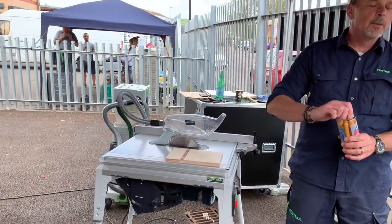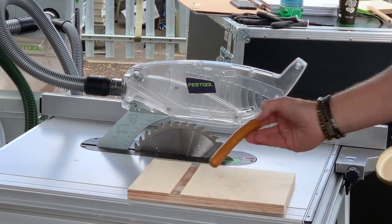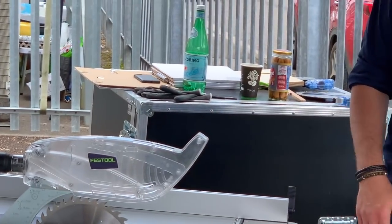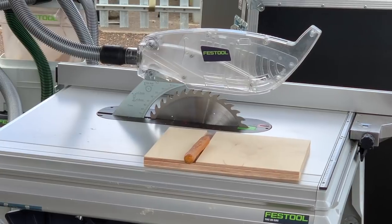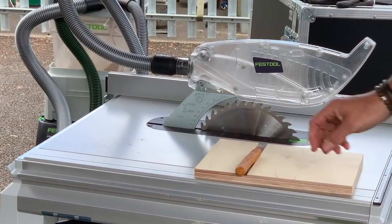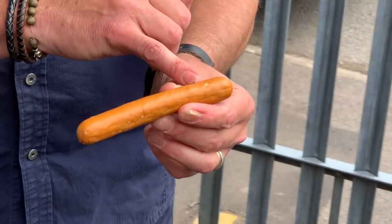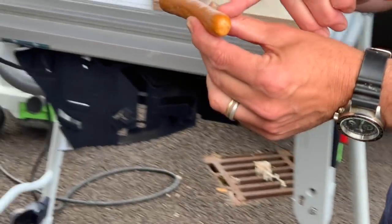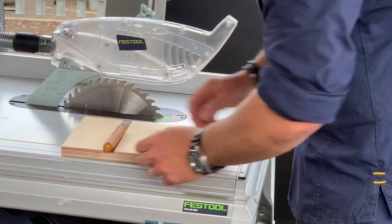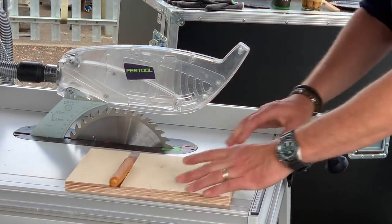All is good — we have the sausage for the dramatic part. It has a certain amount of moisture within it, so the blade is constantly monitored by the electronics on the machine. If it detects moisture, which is conductive, it will fire the brake into the blade and stop it within five milliseconds. You can see the tiny little nick on the blade from this morning's use — it's not covered in water, just enough moisture content. Next stage: bring the fence over and lock off into position.